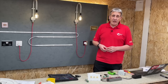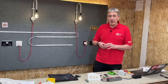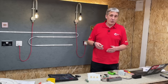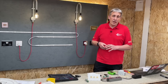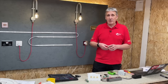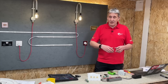That little Ferret PCB is a fantastic solution for garden lighting. Imagine the scenario - you're already building an enclosure to include the LED power supply, and you can just put that small Ferret PCB in there to add control. In larger gardens that can significantly simplify your wiring, because with that 200 meter range you don't need to bring all your wiring back to a central location. You can just put it in the control gear enclosure, or even in a 13-amp socket feeding a specific area - using that small power supply you can turn any socket into a remote switching socket.